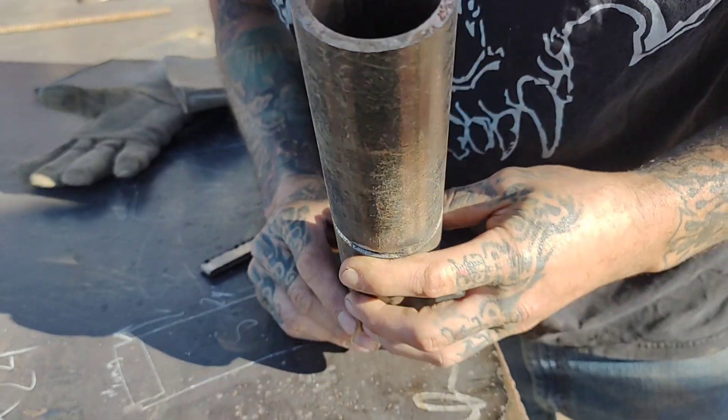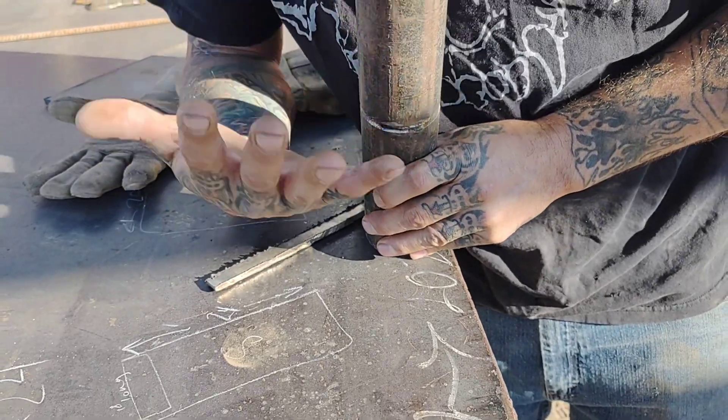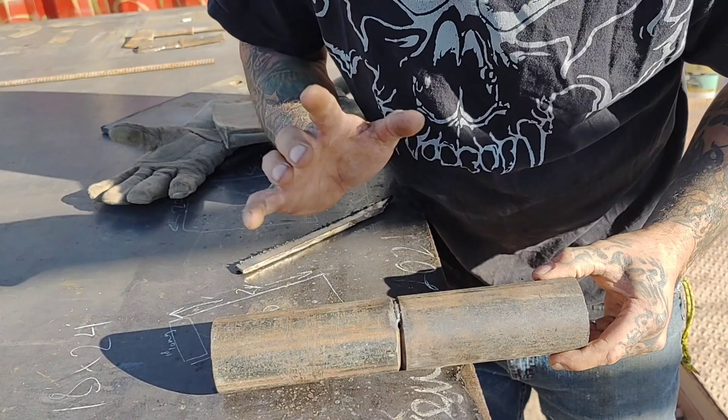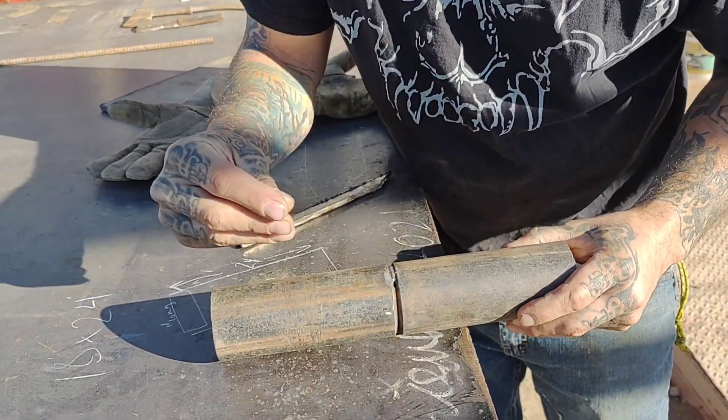A lot of times I've got to take this test at a 6G, and I want the bigger tack on the bottom — basically the meat on the bottom of the test. And on the top, I'm not really too concerned because gravity takes effect on top.